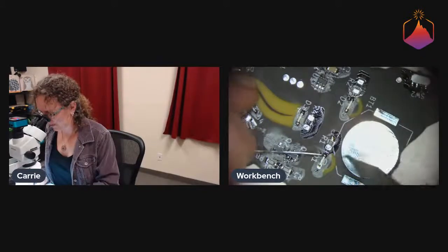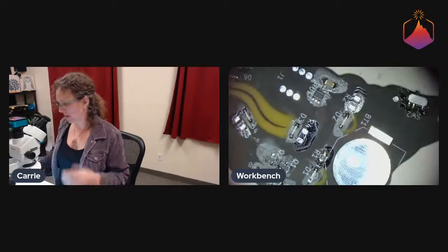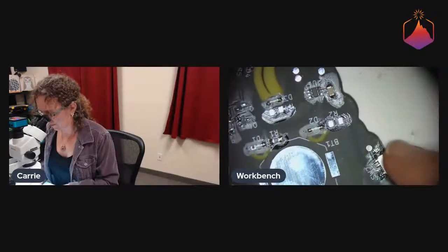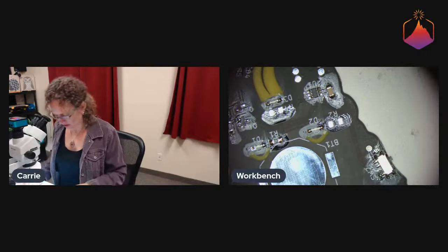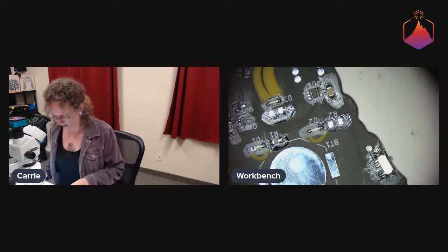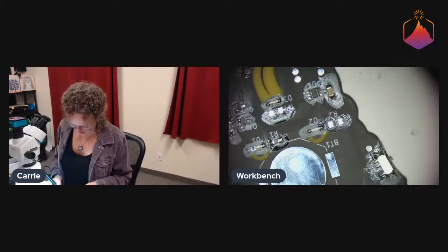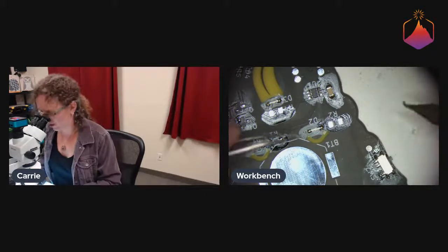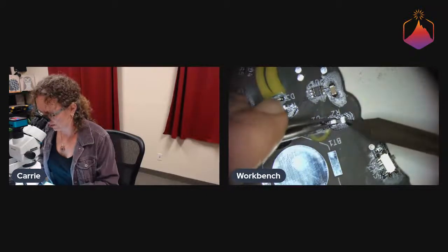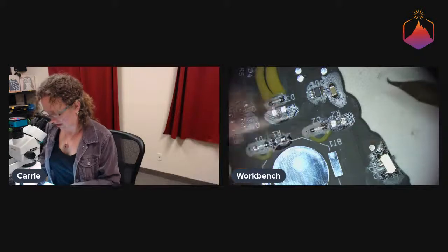So they'll all be hand placed, but we do have a nice frame stencil for these, and a stencil alignment fixture, which they call a manual stencil printer. It doesn't actually print the solder paste for you. That would be really cool if it did. But it's a jig, a fixture, and it allows you to very easily align and mount your boards.